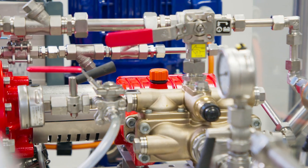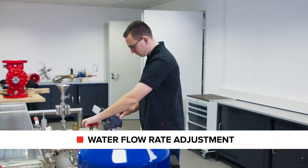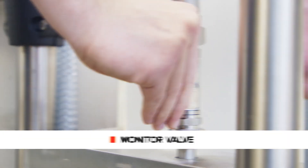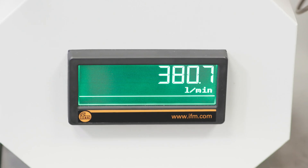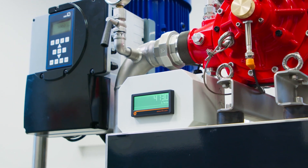This way, the water motor in turn drives the proportioning pump. The water flow rate through the water motor is controlled via the valves to the sprinklers or the monitor. The volumetric flow meter shows the current water flow rate passing through the water motor.